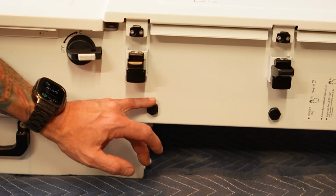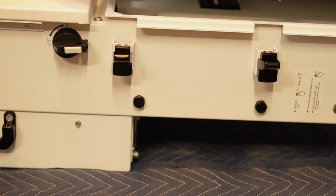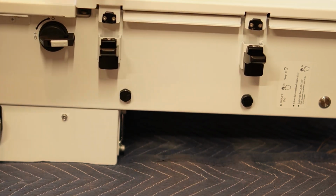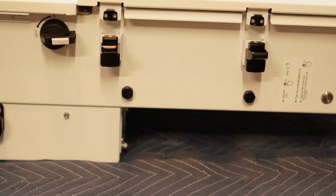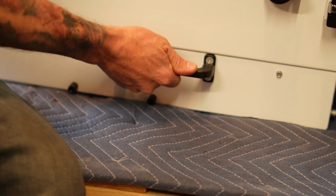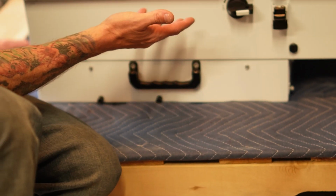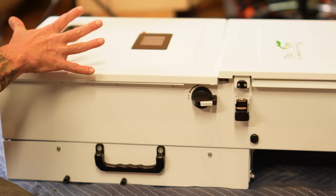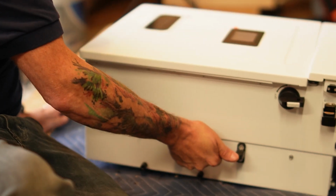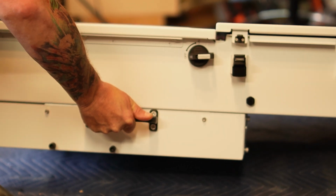Do you think these are... Yeah, pressure relief valves. As temperature changes, so does pressure. So that's going to be like a little one-way to allow air to exit, but not moisture to go in. That's totally cool. These are lifting handles. You notice they're up here. There's one on the other side and not down here. This weighs like 100 and something pounds. All of that 100 pounds is right here. So when you lift it up, this is actually a very balanced point to lift the entire inverter from.